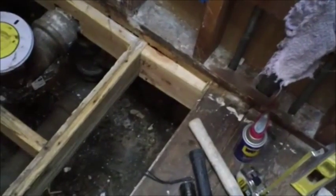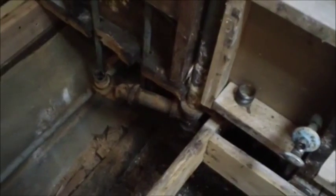You can see that before we put that side stringer in there, we had no way to secure the boards on top of that, any of the subflooring and all that above the hangers. So we've now got that accomplished on both sides, and that feels pretty darn good. So I think we're going to do one more piece for back in that corner, and then I'm going to do some more investigation on the plumbing for where we're going to be positioning the P-trap for the shower, the P-joint there, to get that in a position where it's going to work real well for the linear drain.